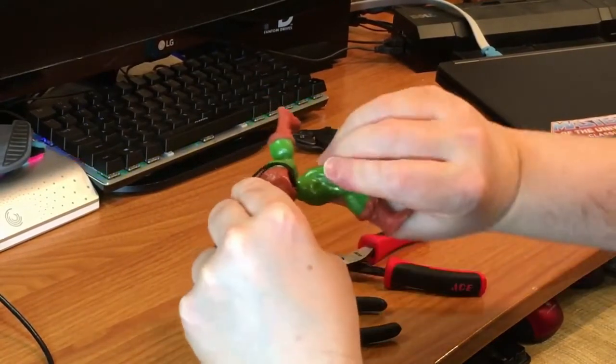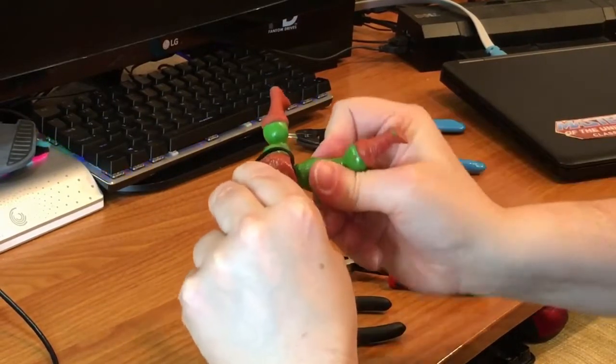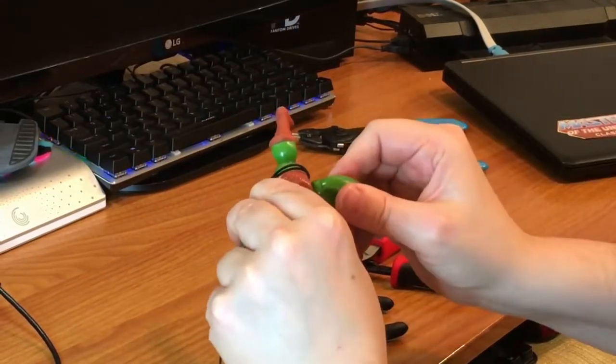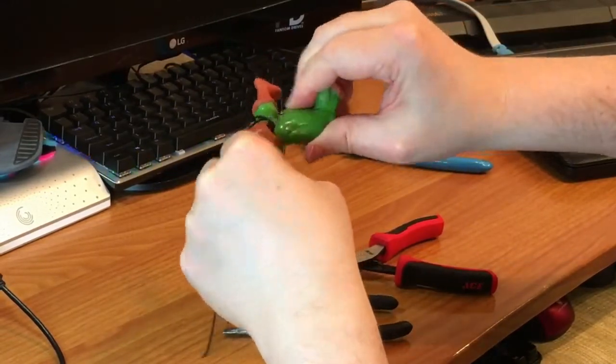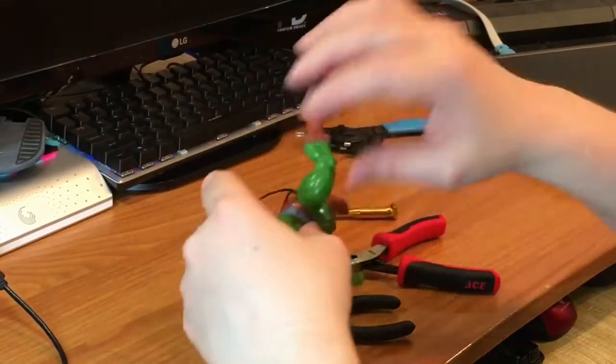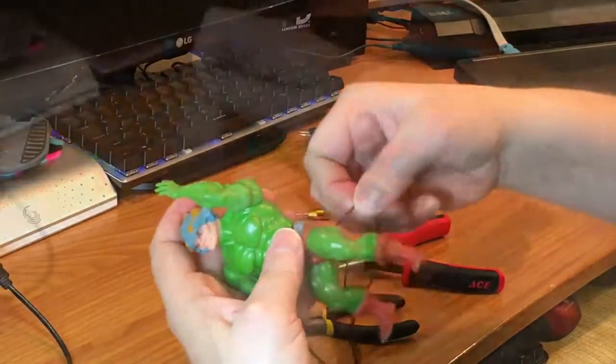Now these screw eyes are actually made to hold quite a lot of weight. That's why I make sure I choose the extra long ones, the ones that are 11/16 in length. And that helps because they're a little bit longer, so they go in a lot deeper and they hold a lot stronger. Alright, let's go ahead and pull the string out now.